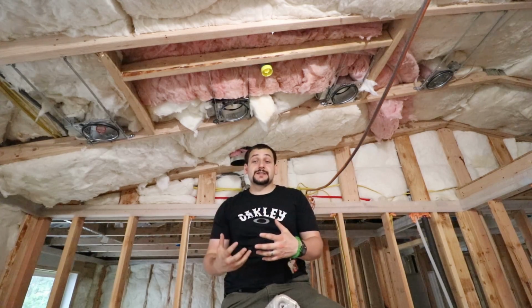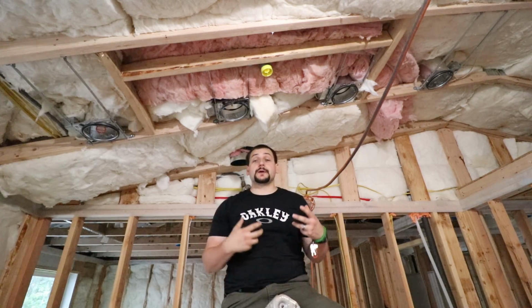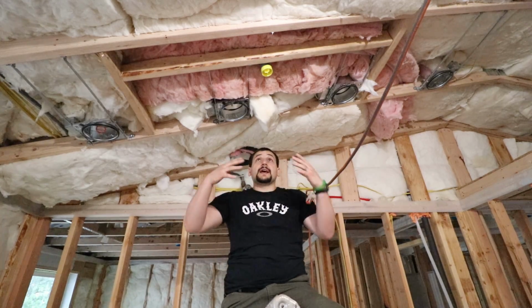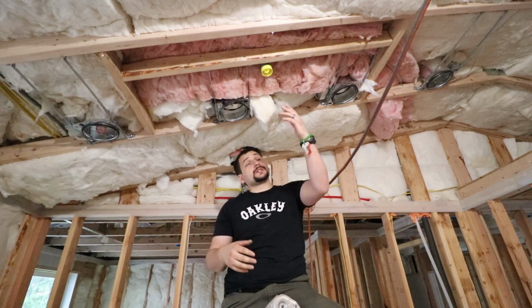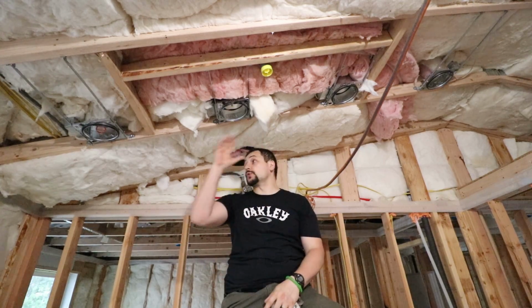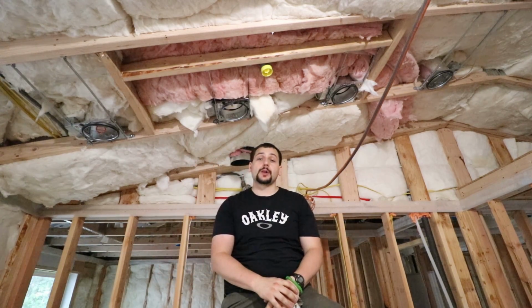I learned about all the inspections. I had to build a test assembly. We got the barrel set up. We performed the test. As you guys saw, we did a dry run. Test passed. The permanent sprinkler head is installed and is ready for sheetrock. There's a lot of really useful information throughout this whole video all about this sprinkler head assembly. I highly recommend that you find out from your local county what your requirements are.